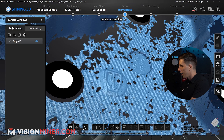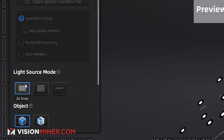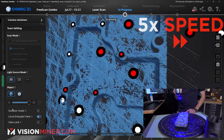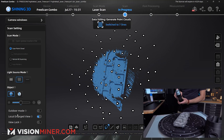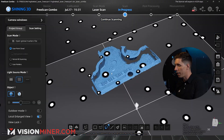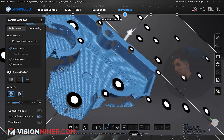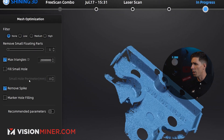We could do better, so I'm going to go back and keep adding to this scan. I'll use 36 laser lines to fill in more of that data, then spend more time on the seven lines to really focus in on that area. I deleted some data I didn't want, rotating the part around — and this detail is looking really good, really nice.